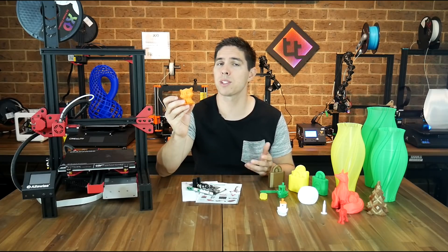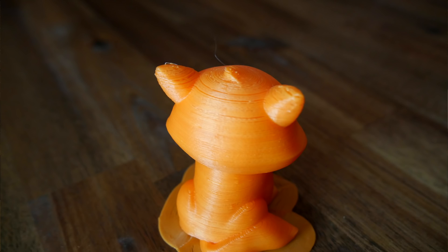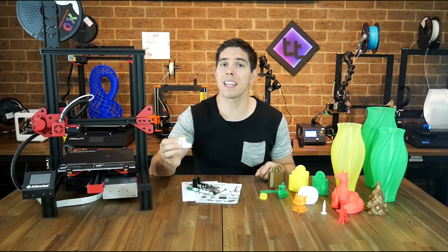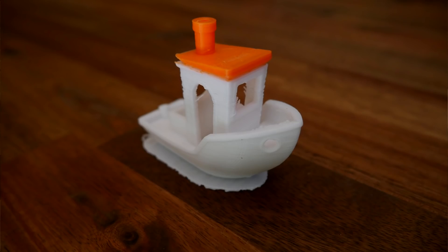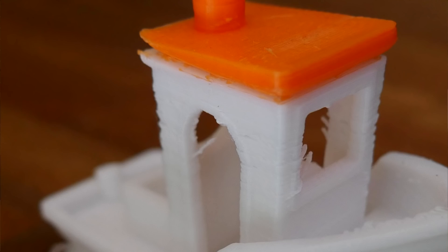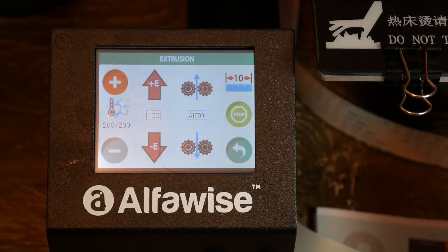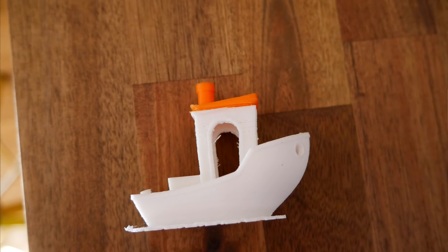Next up, I printed this cat, which was called 'a small fox'. The overall shape was there, but it's hard not to spot all of the missed extrusions around the surface of the model. The last one I did off the SD card was this 3D Benchy, and again it suffered from the same extrusion problems. Even so, I decided to test the filament run-out detection partway through. The under-extrusion was prevalent once again, making surface quality hard to assess. In terms of the filament run-out detection, it seemed to resume in roughly the same position, perhaps a little bit high, because you can see the new layer hasn't bonded that well to the old one.